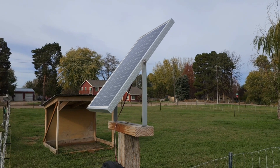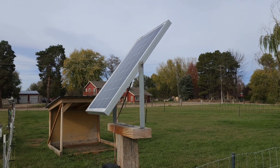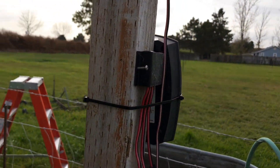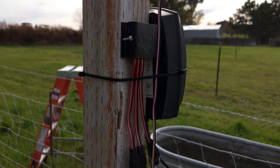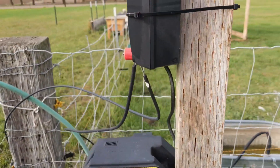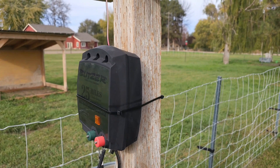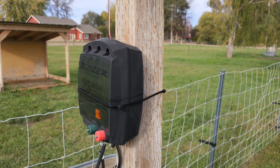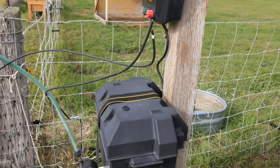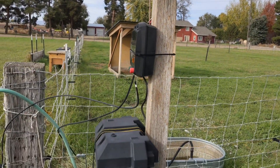Let's go over the components of the system. This system is pretty simple to put together. Up top we have a 30 watt solar panel. From the solar panel we go to the opposite side of the post where we have our 10 amp charge controller. From the charge controller it goes down to the battery, and from the battery it goes back up to the fence controller. So a pretty simple system: solar panel, charge controller, battery, fence controller. The components cost about the same as one of the ready-made units depending on battery size, but you get 10 times the power out of those ready-made systems.